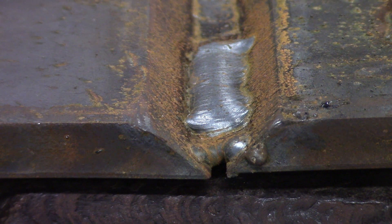This is the first butt joint I'm going to show you — I just pulled it out of the scrap bin. It's got a pretty atrocious looking weld in it, but you can see that's a single V groove. So that's a groove weld on a butt joint, and it's just a single V.